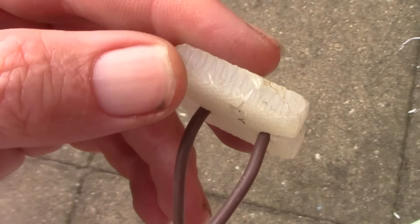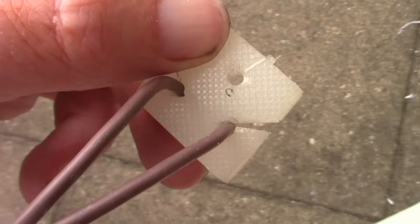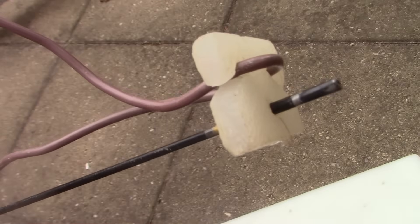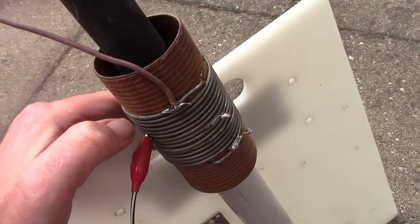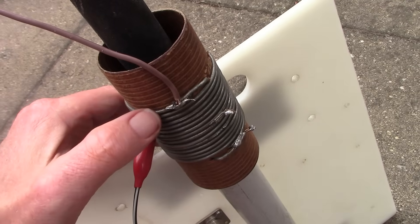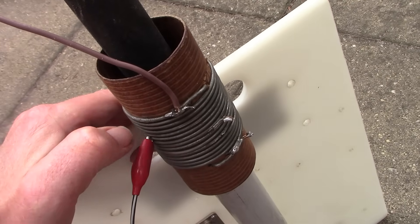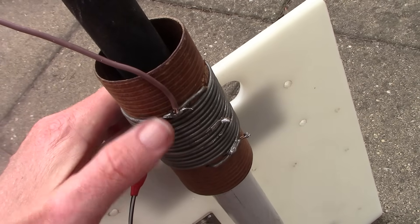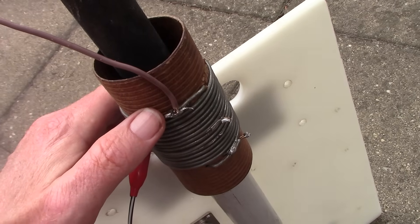Then I've got some more chopping board. There's one hole here that goes into the top of the rod, and the other gaps are just to hold the wire. I'm using base loading. That is mechanically the best way of having a vertical antenna, but it's the least efficient — centre or top loading would be more efficient. But in this case it shouldn't be too much of a loss, especially on the higher HF bands, as we're not too far off being full-sized on 10 metres.